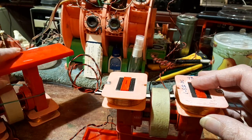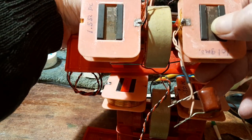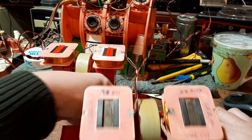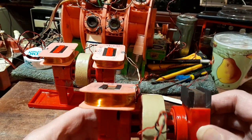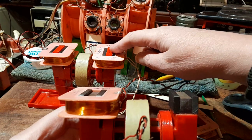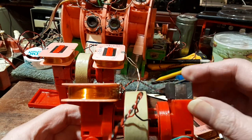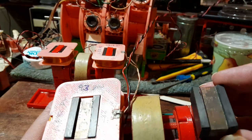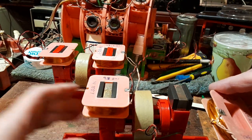My coil goes on here like this, and I arranged it so these would intersect — there's a slight raised plastic piece in the middle that enables it to hook into the recessed one on top, which also has nanocrystalline in there. These are the male and female sections. The nanocrystalline core material goes all the way through to meet up with the others on the other side, but there's a slight gap where the plastic bit is in the middle. The ferrite material bridges only a couple of millimetres, so the losses are minimal. I just noticed there's actually a bit of rust in there.